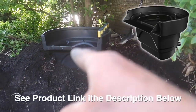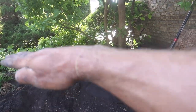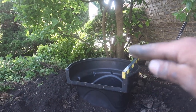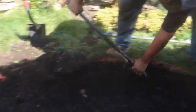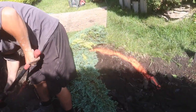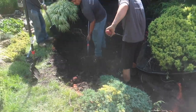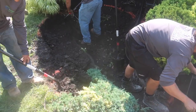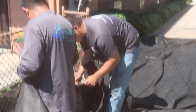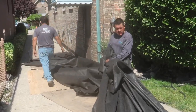We've got the new 2500 Series Biofalls in. It's angled facing more towards where Mito is at. We pushed it back about eight inches. We're going to build up a berm all the way around the backside, and do a boulder retaining wall to help protect that magnolia and the azalea right here. You can see the shape is kind of staying the same — we're just going to bump out that edge. Skimmer is going back in the same spot and we're going down to 24-inch depth for this pond. We're not going to have a whole lot of shelves. Excavation is done — time for fabric, liner, and more fabric, and then we will start to rock and roll.